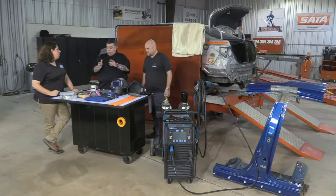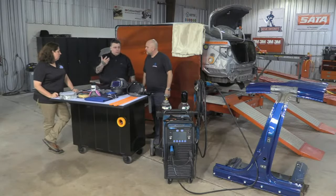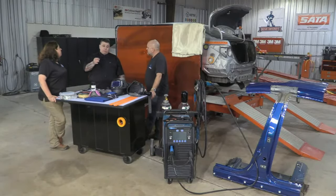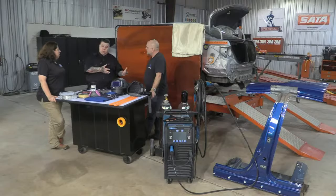so you can cut it up into multiple small pieces like this. You've got a lot of welds on this car, a lot of practice welds. Mark it off and say, all right, I'm going to make my practice welds, do my destructive testing, make sure I have the proper penetration, the proper weld length, depth, and width, and then rip it apart and make sure I have the right tear out. Yep. So at least I can have the confidence when I go to weld on the car that I should be okay.